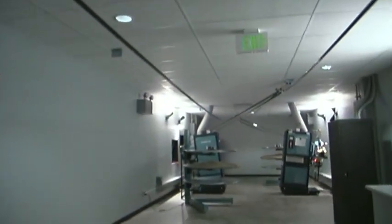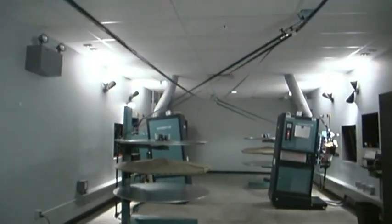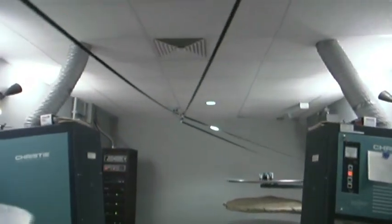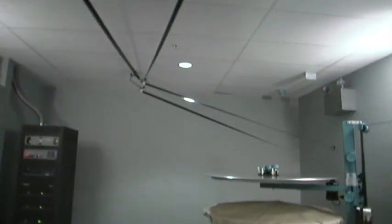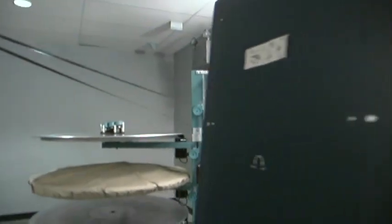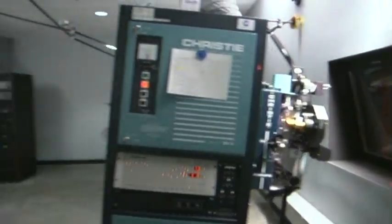You can see here where the film enters the payout side of the platter, makes its way through the projector and through the take-up side of the platter, heading back up to the interlock rollers on the ceiling. You will notice there are no accumulator rollers of any sort on the ceiling. For this demonstration, we are disengaging the top deck of each platter and utilizing the take-up arm as an accumulator. This only provides an absolute maximum of two seconds error in either direction. Due to the use of this incredibly strong Kodak vision leader, if one of the start times had been more than two seconds out of sync with the rest, a certain disaster would have resulted at the start of the interlock.